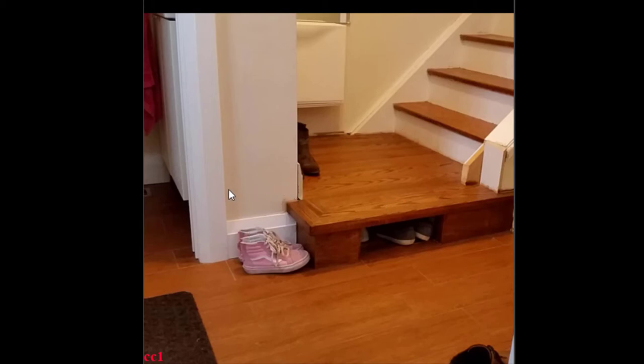Here I already got rid of everything and I redid it all. I finished it with the landing. Here I provided a little niche for shoes. As you can see, beside this, a 10-inch deep vanity sits right in that niche. I changed the steps and I still had to provide a post. I covered all the steps and risers — the treads with solid oak and the risers with veneer oak-look material.